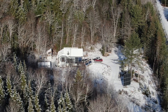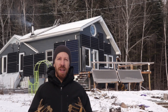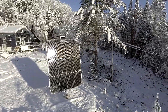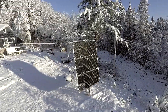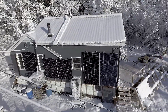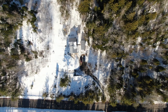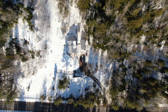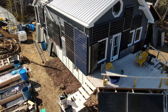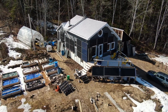This is lowered further by changes in the landscape and objects that cause shadows, like the nearby trees next to my house. I estimate that about 30 to 40% of the light hitting the panels on a bright sunny day in the snowy winter is actually coming from the albedo effect — the reflected light off the snow. The days of peak solar production intensity I have on record are essentially March and April, when the intensity of the sun and its angle to the earth makes the albedo effect strongest for the year. As spring continues, the albedo effect diminishes as the snow melts, until the low in the summer where it's still present, but much, much lower.